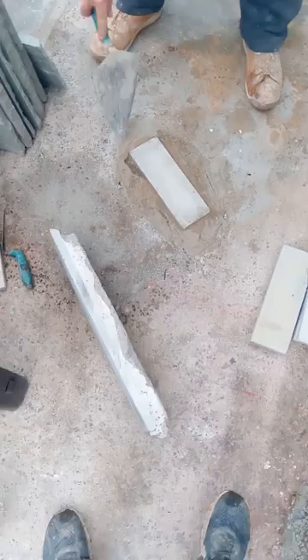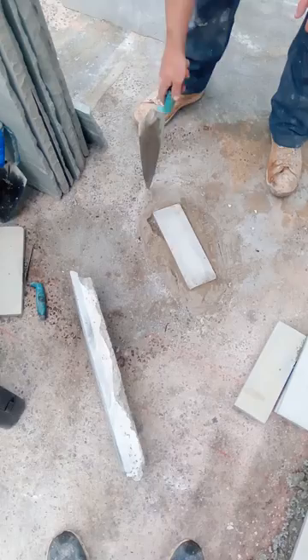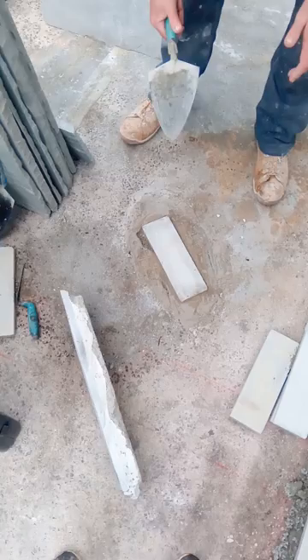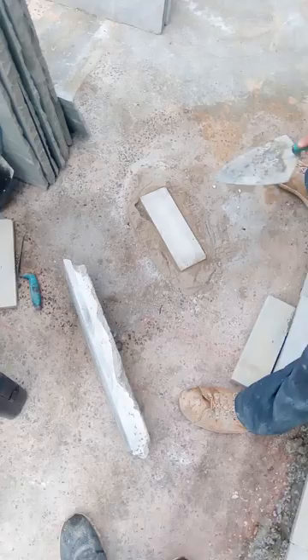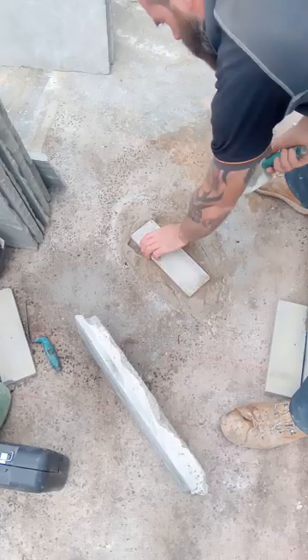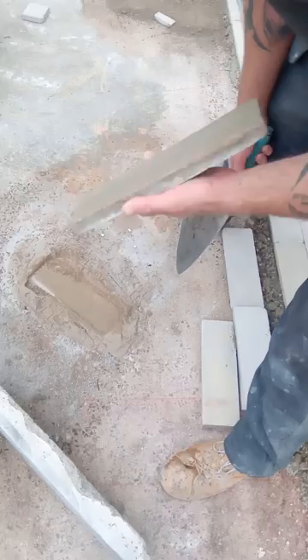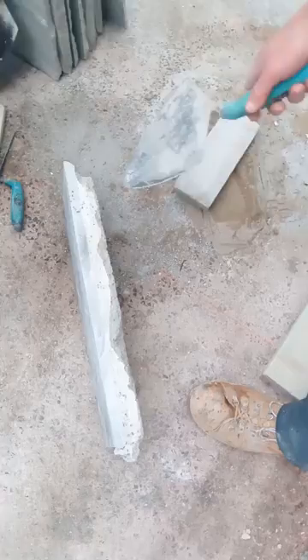If we bring the camera down, we can see the one on the soft sand that I laid yesterday - it's still there. Some of you pointed out that this mix was rather wet compared to my grit sand, and yeah, you're right it was. But the purpose of my video wasn't to have a perfect mix - it was just to explain the physics of what's actually going on, what's scientifically happening with the sand. He's still in there where we laid him yesterday. He's got a good suction. If I try and work my chisel in on this edge I'm going to be able to pop him - there we go. I popped him quite well. Good suction, well appreciated. The mix hasn't gone off yet, it hasn't fully cured. This is the day after. I took a cut out to give you another example.